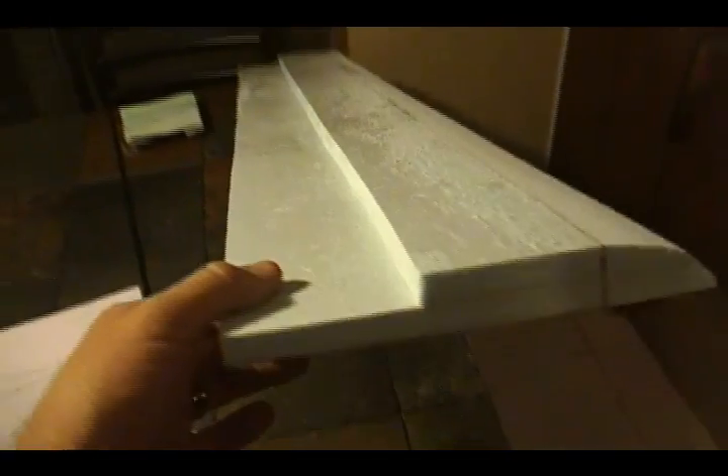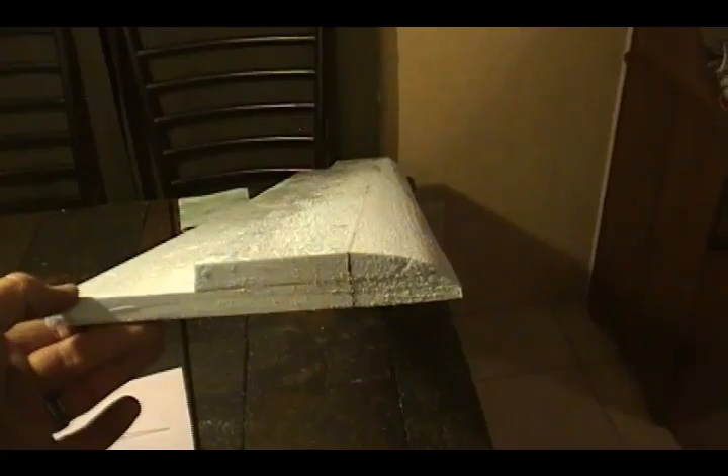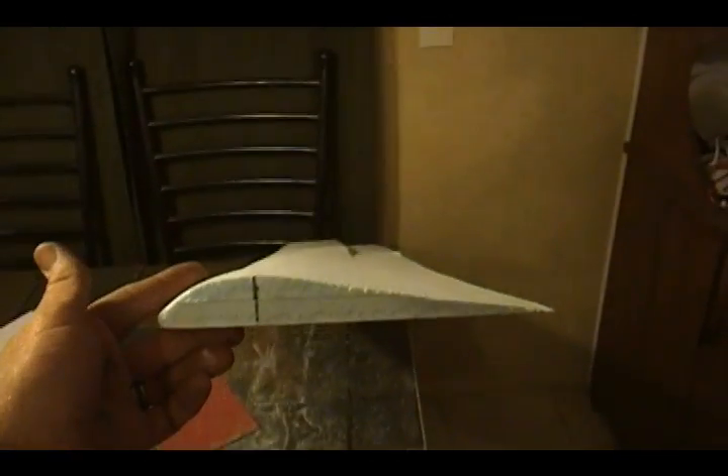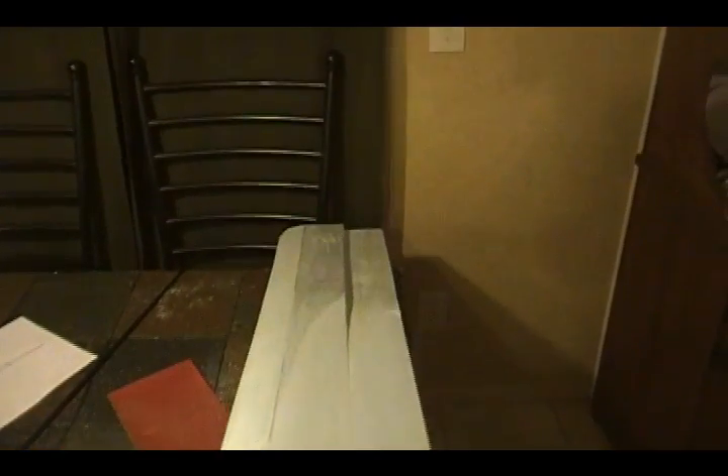This is my wing. I've taken two pieces of foam, glued them together offset, and I've already started sanding the front. I printed off a standard airfoil shape and that's how I'm shaping my wing. After about 10 minutes and a large pile of styrofoam dust on the floor, you can see the general shape we're accomplishing here.